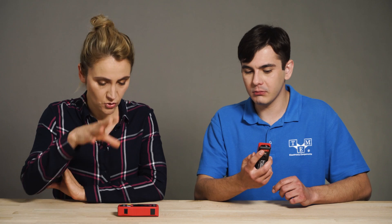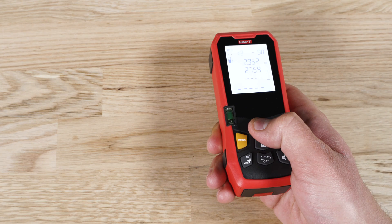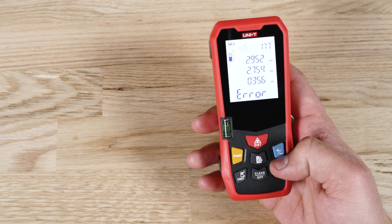If you're Mr. Smarty Pants, can you show me how to use your LDM? You take it, point it, click it — and that's all. Not quite. First, make sure the LDM is placed on a stable surface perpendicular to the ground. If you use it with shaky hands, it will not be as accurate as it can be. If the LDM returns an error, check if the target surface is acceptable — for accurate results, you can place a white paper there. On the other hand, if there is too much background light, darken the target surface.